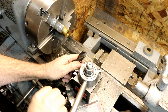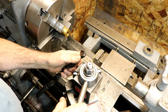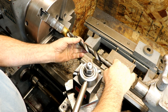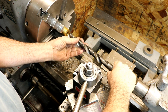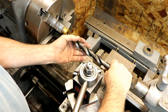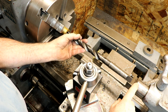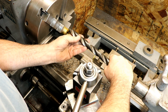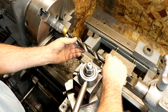So you're going to drill some brass. Brass, if you've ever drilled it before, you'll find it is very grabby. As you're drilling, it will want to grab real hard on your cutting edges and pull that drill right in. A lot of times it will pull it right out of your tailstock if you're using the taper, or it will spin in your tailstock. It can be very grabby material.